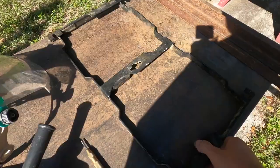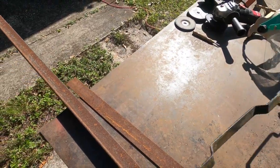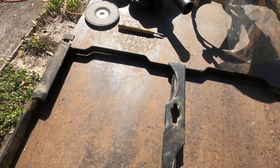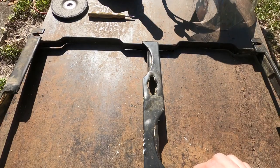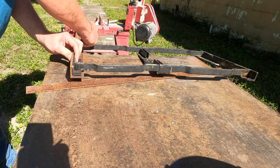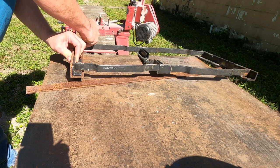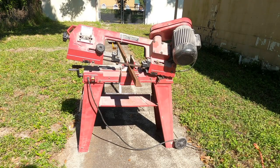After looking at the situation with the rack I decided that I'm going to build a new rack. I have a couple pieces of metal that I'm going to cut up, and I'm going to use the existing rack as a template. We'll lay that out, mark the holes, and then create the same end, then put a piece right down the middle for the new batteries. It'll basically be an H instead of this frame. I want to maintain the original frame in case we want to go back to the old batteries. I'm going to use this to mark the length, copy the existing one for slot locations, cut that, drill a hole, and cut those out. I'm going to need two of those.